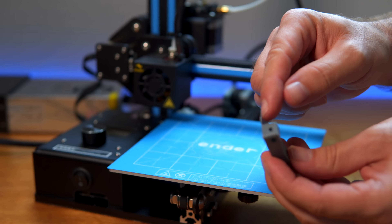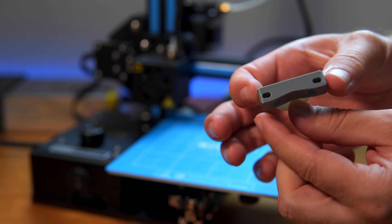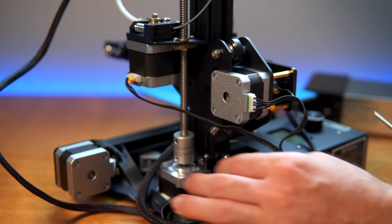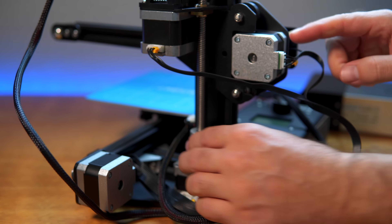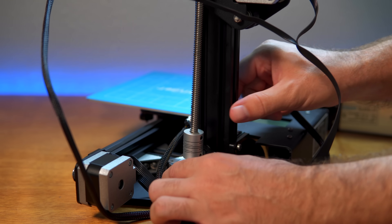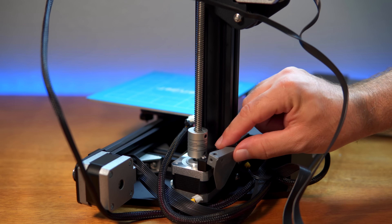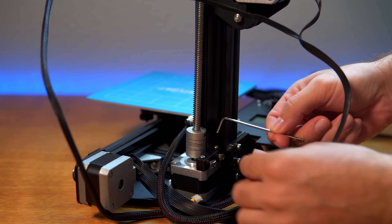The point of this piece is to shim it from the back side and also move the stepper motor side to side on these little slots. The next thing is to pull out the whole motor. What we're replacing is this black bracket back there. I'm going to run the gantry up to give us more flexibility, and now we can pull out the motor and spin it to get to that piece easily.